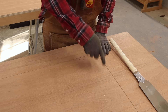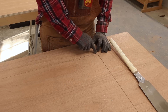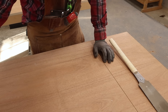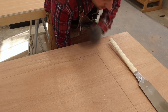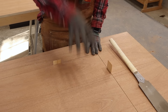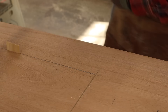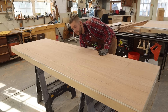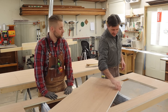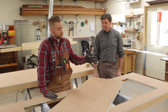It's a good tip when cutting out a panel like this — you run the risk of the piece wanting to fall through when you finish the last two cuts left by the circular shape of the saw blade. You can actually wedge these with some shims from underneath so it won't be able to fall. That worked out fantastic. It's a really nice cut — quick and easy with the track saw. It makes these difficult cuts easy.